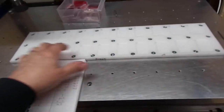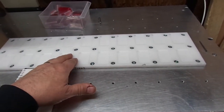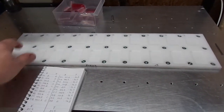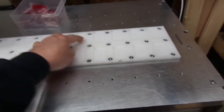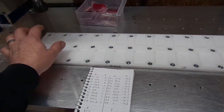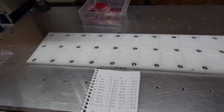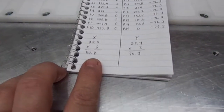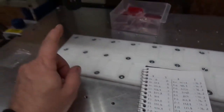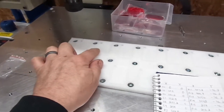I've got the fixture laid out here. Each part's centerline is 2 inches apart and from row to row is 3 inches. The machine works in millimeters: 25.4mm is 1 inch, times 2 is 50.8mm. So the X and Y starts at zero. When I fire the machine up, the spindle is all the way up and directly over the origin holes I drilled in the center.